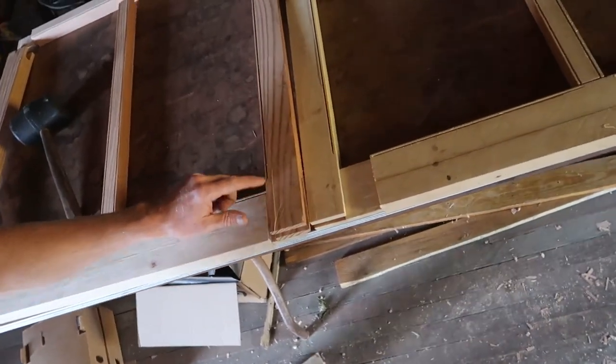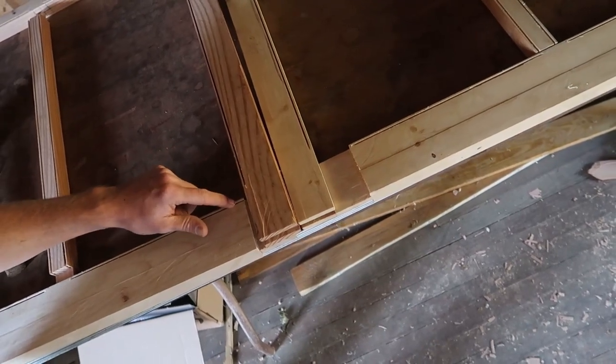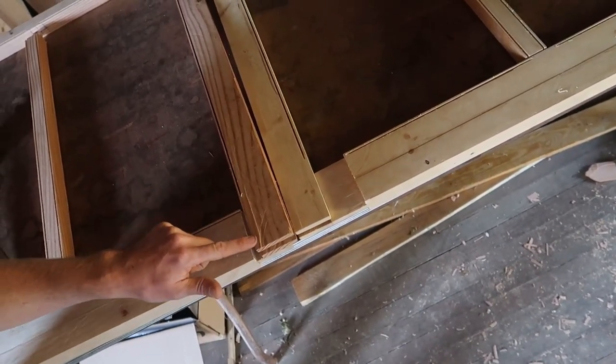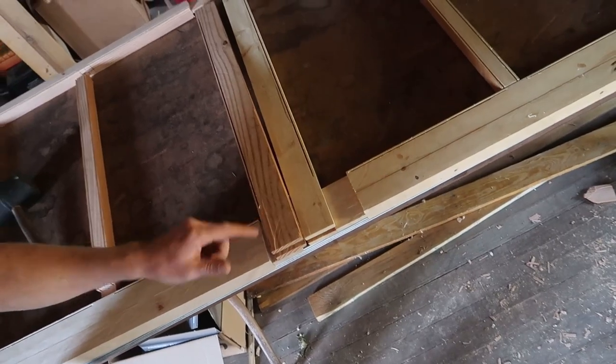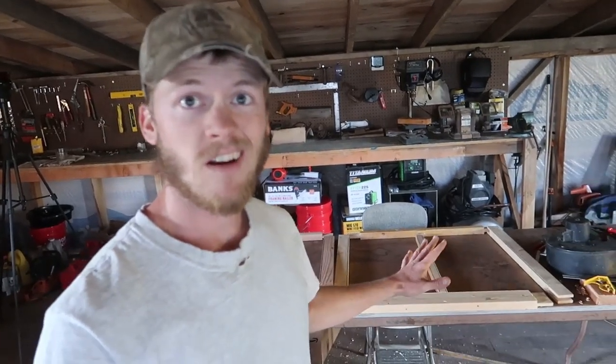And over on the side pieces, again, you want your groove to come just down into the corner, and then you want it to stop before it hits where it meets up between here, because you don't need the notch going all the way down. Again, it looks better. So from here on out, it's hand tools only to get these things finished up.